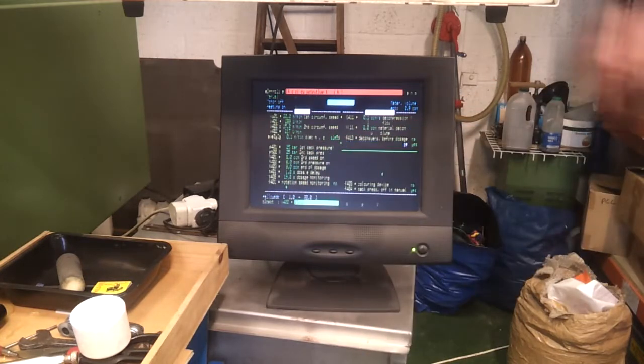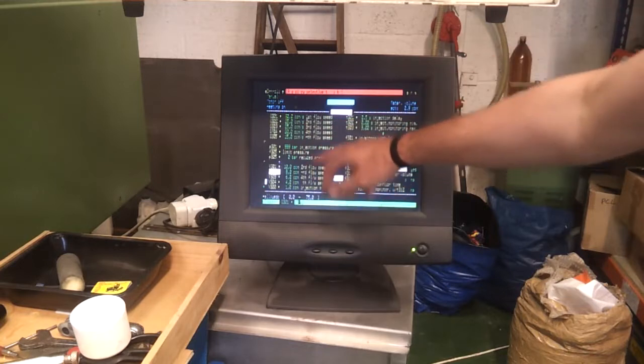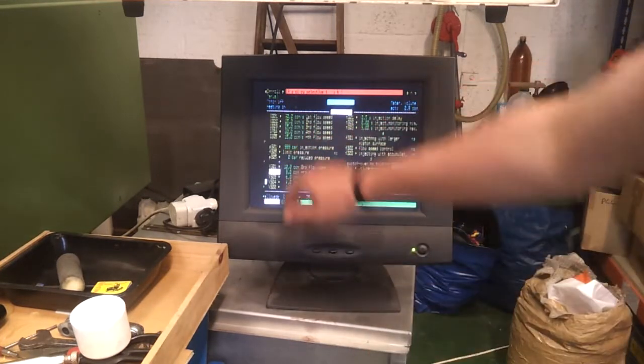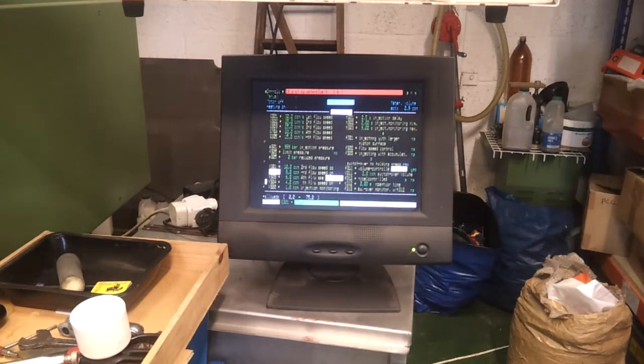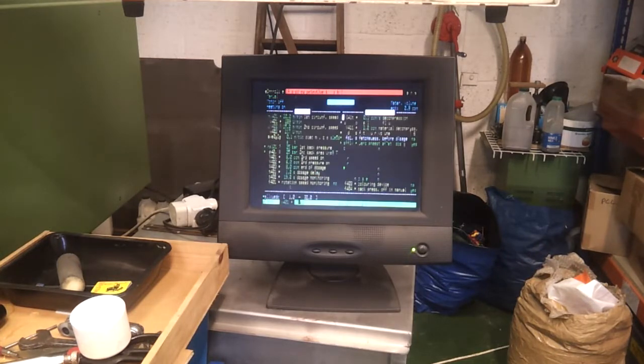Modest amount of back pressure, and the injection going in about half speed, 30 cubic centimetres per second. It should fill in less than a second. And about 1,000 bar, and that's pretty much all we need. Temperatures I'm running at around 200, slightly hotter on the tip, and that should be all we need to give this a go.